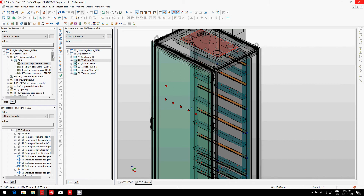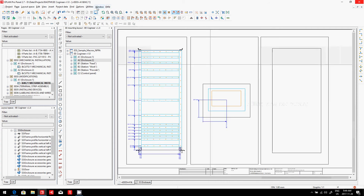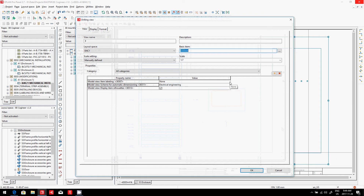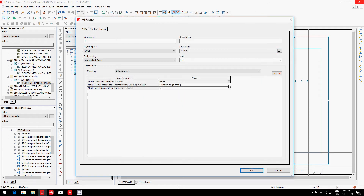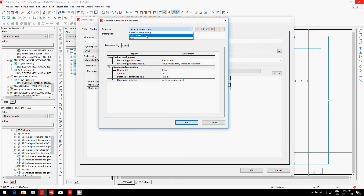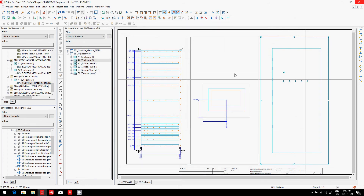Once this is done on the 3D side, you can close your editing. For step number three — the modification of the panels — you can create views that are technically always up to date, so these holes will show up automatically. You can even put a specific item labeling when you define them, or you can also add dimensioning for these holes — mechanical, fluid, or whatever — and this will give you the dimensioning for it.